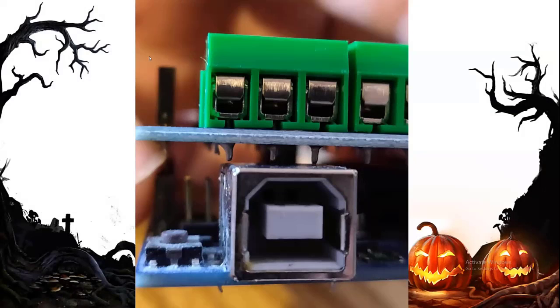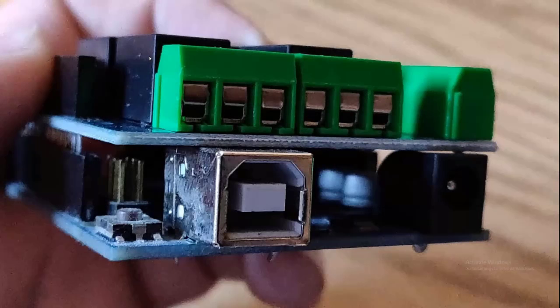There is a picture of the problem. You see that the top board is stabbing the bottom board, and those pins are touching the USB plug on the bottom board. So we have to grind off those pins on the top board, not quite all the way, but just down to a bump. So we want it as flat as we can without messing up the circuits. And this is what it looked like when I was done, but you can see that now that those three pins are flat against the housing of the USB port, there's going to be conductivity. So I needed to insulate them.